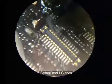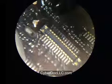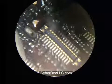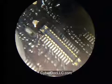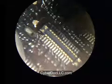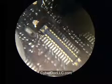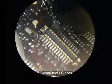It doesn't. Oh, also I should note, it's not where you buy the flux. It's really what's inside the flux. You want no clean electronic grade flux. Not all no clean flux are electronic grade, meaning they have strong inorganic acid in it. It can corrode the board. The flux I'm using, it's weak organic acid. It's very weak, so it's not corrosive.